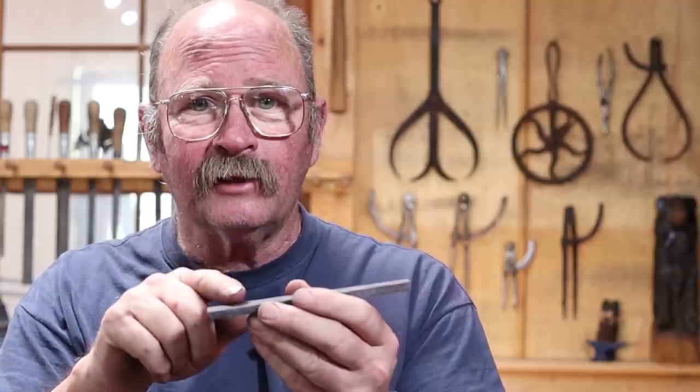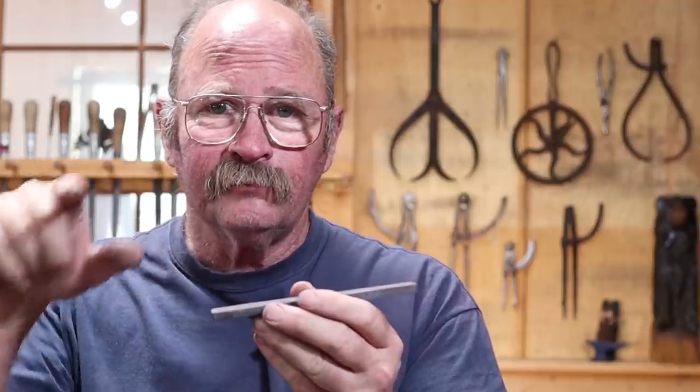These are unlike most modern hinges that have a hinge pin that everything rotates around. This style of hinge uses a pair of rings that go on at 90 degree angles, and that's what the hinge pivots on. So one ring is in the same plane as the hinge strap, and the ring on the other strap is in the opposite plane. And we're going to form these rings by drawing out a thin tail on the bar and then forge welding it back to make the ring.